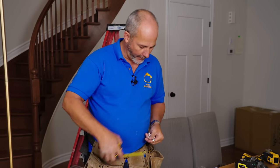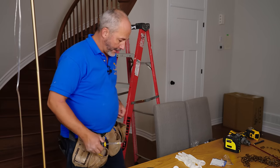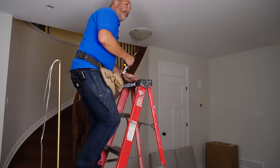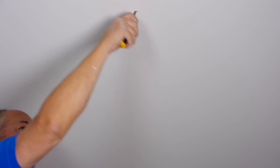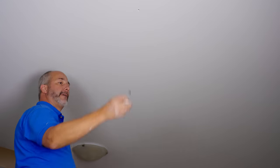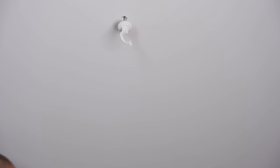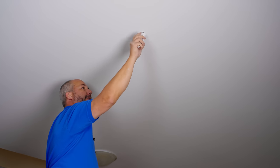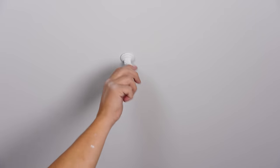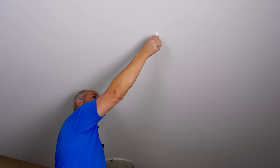Always go backwards to find your thread on machine screws. This is a special type of drywall hook — it collapses, goes through the hole, spring-loads, and carries weight. Half-inch drywall with this kind of toggle bolt is rated for over 80 pounds; this is a three-sixteenths, so we're fine for this light. If you have to hang a major chandelier with metal, beads, glass, and multiple lights, check the load rating — in most cases you can't mount those to drywall alone. For a fan light, you need wood blocking from joist to joist and the octagon box mounted underneath — just hanging a fan off a box with two screws is guaranteed to come down. Make a half-inch hole, pinch the toggle ends together, push through, and turn clockwise with downward pressure until it's nice and snug.